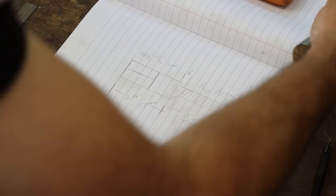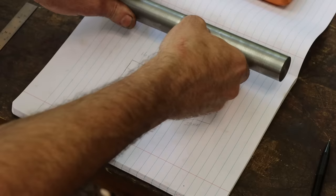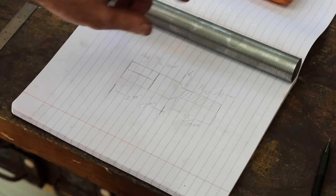We are gonna be making it out of a piece of grade 8 bolt. This is just a large grade 8 bolt that I got. So we'll make it out of that. Should be plenty sufficient. So let's go over to the lathe. We'll blast out the body and the thread, and then we'll take it to the mill and do our hex work in a 5C collet block.